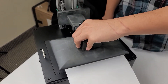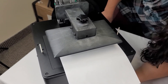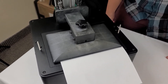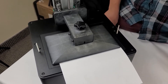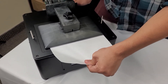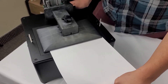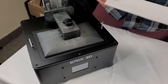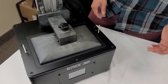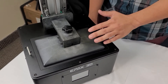So we're going to go ahead and put the platform back on here and send it back to the home position. Now we're just going to tug on the paper. You should be able to pull the paper out with some effort — not so much that you end up ripping the paper, or that the paper simply pulls the printer forward. That looks pretty good. The tension's pretty tight there.